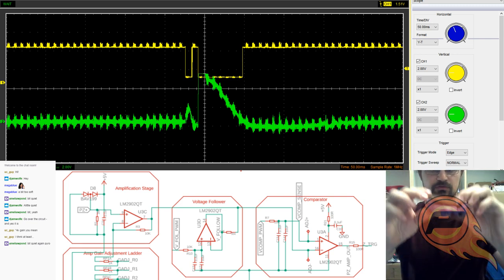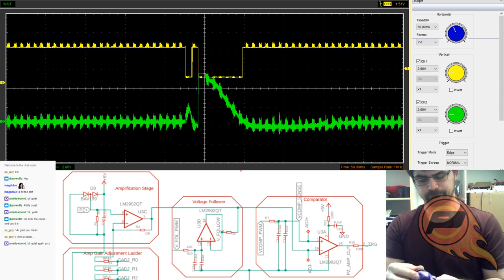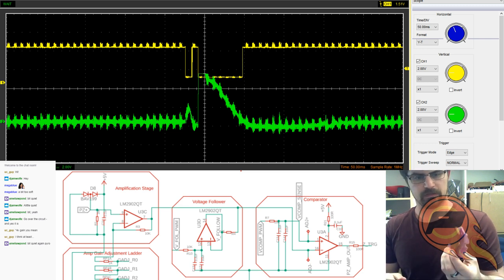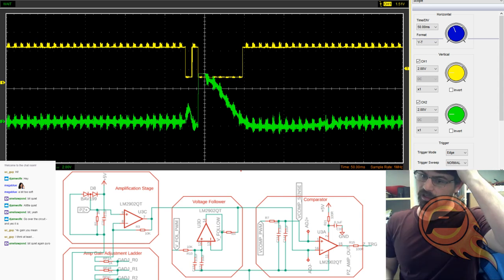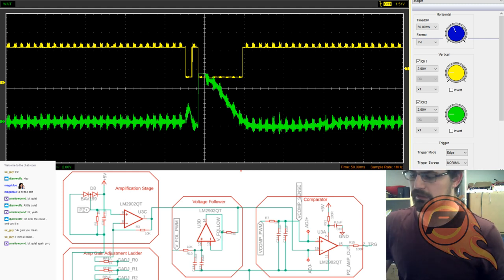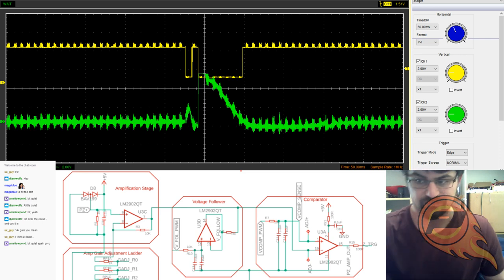Between having the two different spots to keep the extruder plate firm, it's got enough wiggle that it'll be able to poke the piezo disc on there. And all you need is a little bit of flex, as I'll show you on the Monoprice Delta Mini in a minute here. But if you don't have any flex at all, then it won't work. So you need to have just a little bit. The stiffer it is, the better. But that depends on how you machine it or how you engineer it. And I'll be doing a lot of iterations with you guys, making sure that it works on your printers and whatnot. So I'm open to suggestions. I've got some good ideas occasionally, and I'm sure I could probably do things better in certain circumstances.